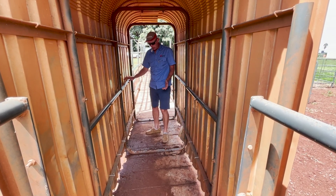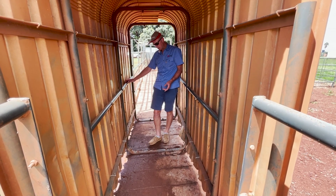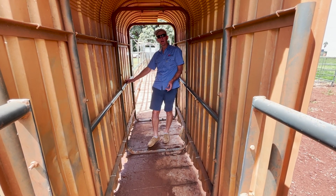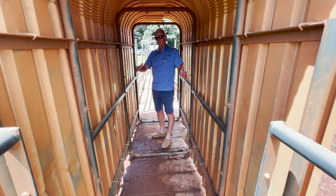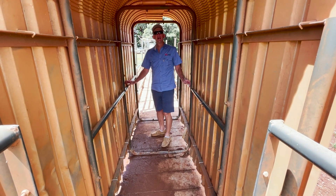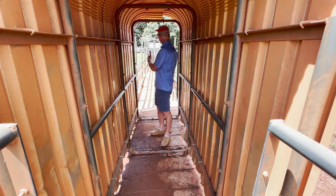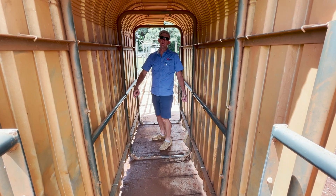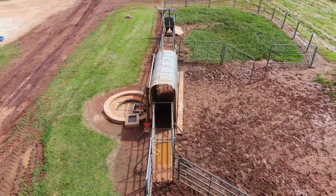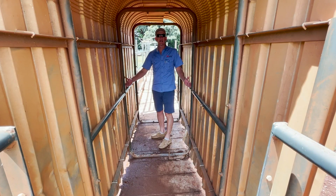And if they're above the surface like they are here, the cows will tend to kick them, hurting their hooves and breaking your nozzles on a regular basis. We also find that this spray race is a little too wide — you can either put in a complete race like the ones behind me or some poles attached to the side to ensure that the cattle can't turn. This width is actually too wide.